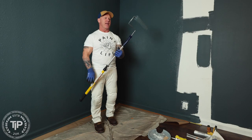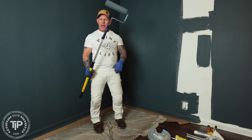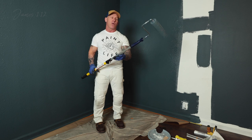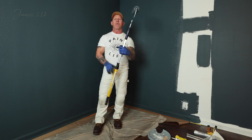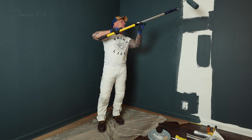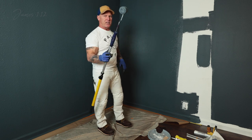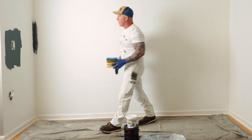Here's a do for painting when it comes to your rollers dripping paint: just keep the roller rotating all the time. When I take it out of my pan and bring it up, as long as I rotate it I'm not going to get any drips. I can hold this thing, do whatever I want, and as long as I'm rotating it coming from pan to wall, I won't get drips. The same holds true with the brush. So one of the do's of painting: always rotate your roller as you go from pan to wall.